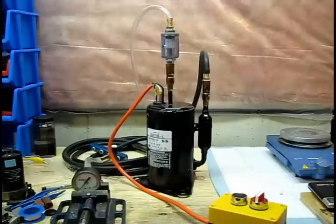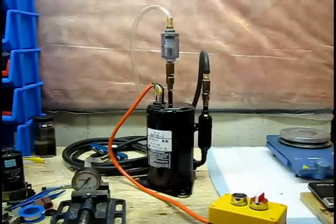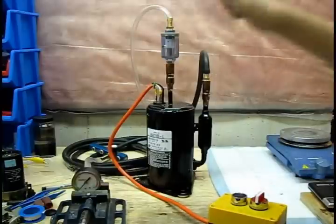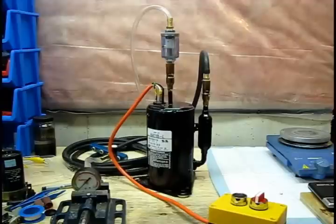However, scroll compressors cost way too much. One thing I've noted is that these R22 compressors — because Freon is being phased out and you can't really use it — you can actually get these pretty cheap. I don't know whether you can use an R22 compressor with some other refrigerants, but I'm finding that a lot of surplus stores are starting to have these show up on their shelves. I bought this one for $15, and this whole setup probably cost about $30. So take that for what you will — it's a cheap vacuum pump.